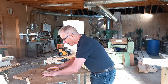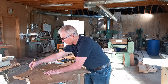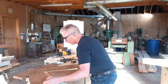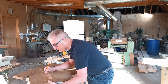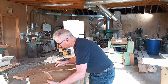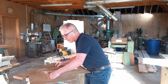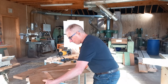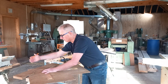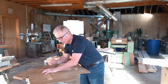So once I have that in position, I'll clamp that. Now this isn't on it at that stage. I'd have the 2 screws out and the fence hasn't arrived on it yet. So I'll clamp that once I have it exactly in line with the 8.5 millimeter mark there and here. Okay, there's a tiny little bit of adjustment needed. You need to be accurate with this because you're setting it up for the first time. I will clamp that in position, come along and just push the fence down onto it and put in 2 or 3 screws to triangulate it, and that'll hold it.